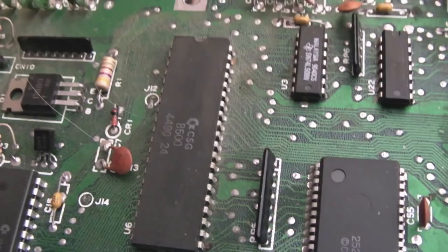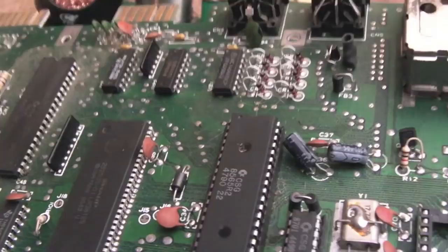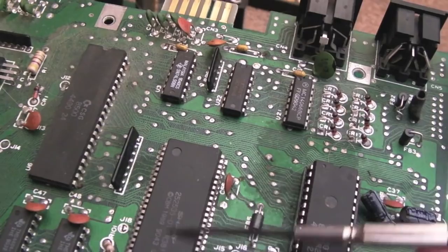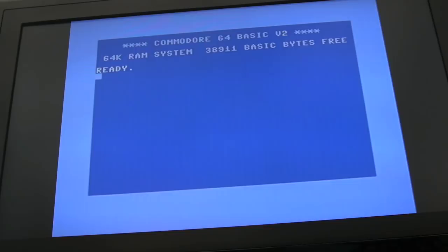I think what we'll do first of all is just plug this in and give it a try - perhaps get the diagnostics card onto it. From the description I'm kind of suspecting the colour RAM, but you can't always go off descriptions on eBay. Someone could say colours are not right or it's flickering, which could lead you to think it's either the VIC or the colour RAM, but it might not be. We could have a logic fault in the PLA, a problem with the VIC, or it could just be corrosion and dirt. So I'll isolate it on the box and switch it on.